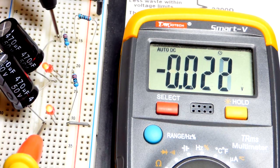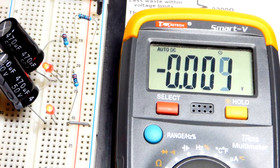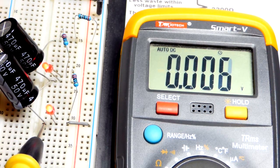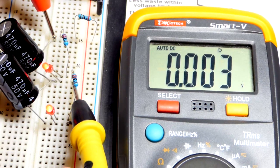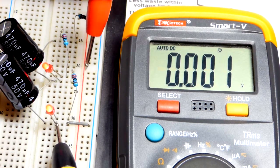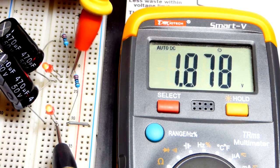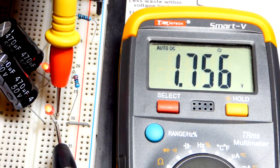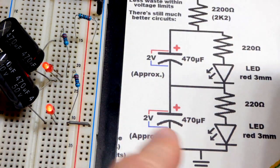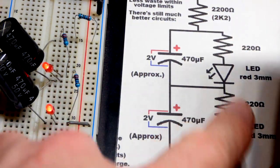We will see that now we don't have the 5 volts anymore because we have the resistors and the LEDs. We could use a lower value resistor to hold it a little better. But mostly it is that we have current flowing now, so we can't build up as much voltage. The red LEDs have a forward voltage of about 1.8 volts. So we can use a semiconductor to limit voltage — it's kind of like a release valve for voltage.